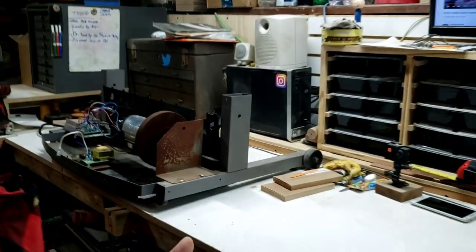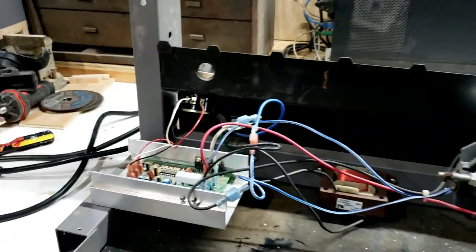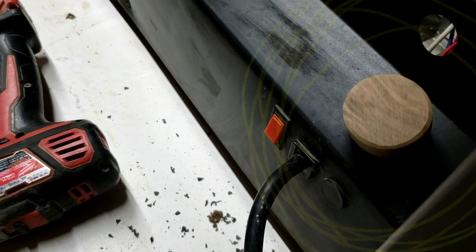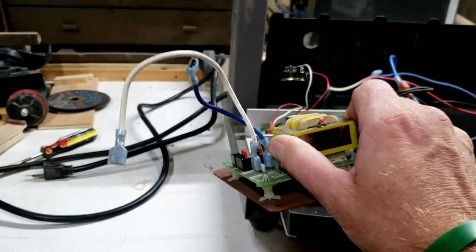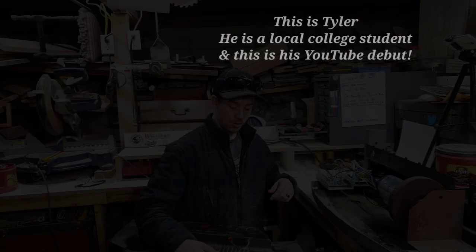So what we are doing, with Tyler's help, we are repowering and eliminating the upper control board of this treadmill. We have added a potentiometer right there with a minimalist knob. We've been able to eliminate this — it's actually the control board that comes from the upper control panel that basically reads the speed signal from the belt and tells the motor how fast to go. That was really our issue. So we've been able to eliminate that. We're going to pop over and Tyler's going to explain what we are going to do real quick.